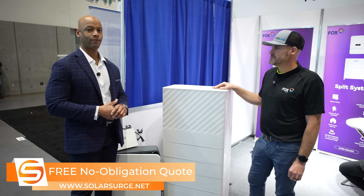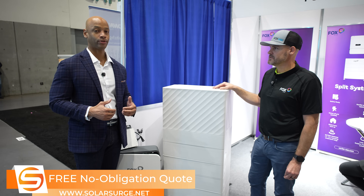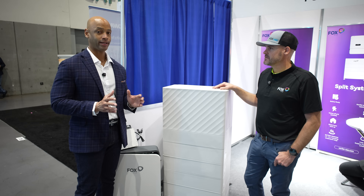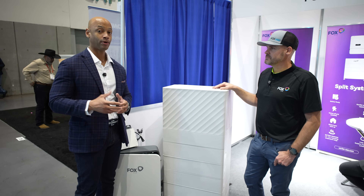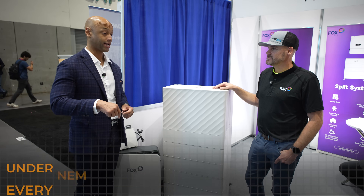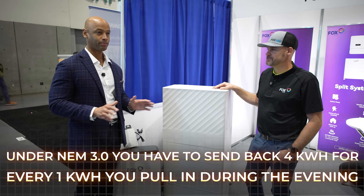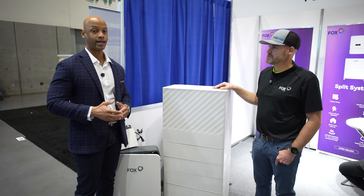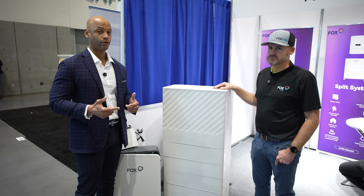Why haven't people heard of Fox ESS before? The reality is that America is actually behind the rest of the world in the maturity of the battery storage market. I've been doing battery storage for the past 12 years, but up until now it's been a pretty niche community in the US because most utilities were offering one-for-one net metering. If you wanted to go solar, you didn't have to worry about storing your own energy — you'd just power your house during the daytime, send excess solar back to the power company for a full net metering credit, and pull back from the utility in the evening. But all that's pretty much going away now, especially here in California, which did away with one-for-one net metering back in 2023. The rest of the country is most likely going to follow, which means people are going to be installing batteries more often than not with their solar.